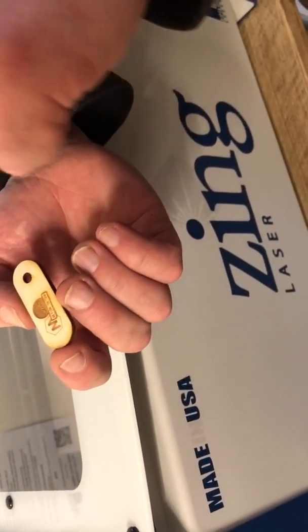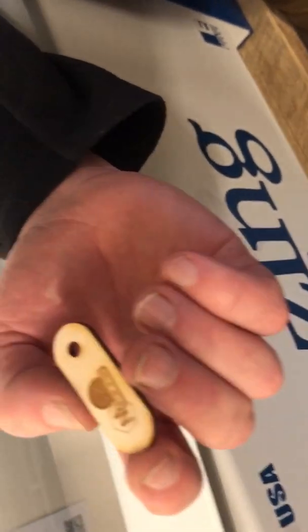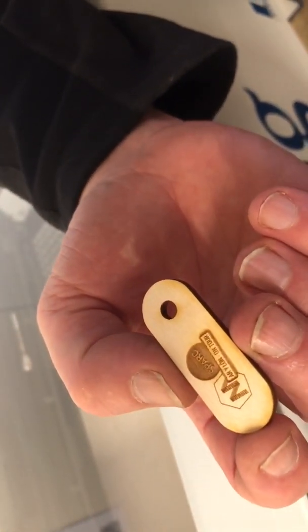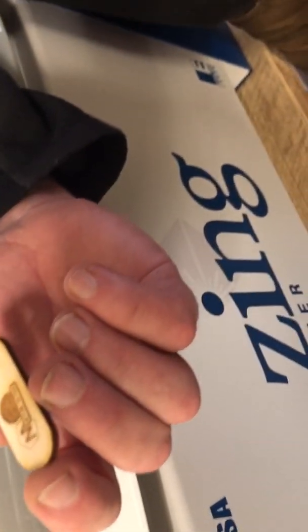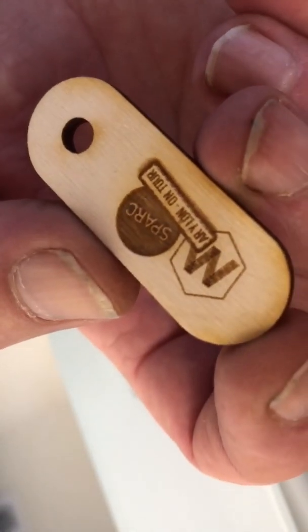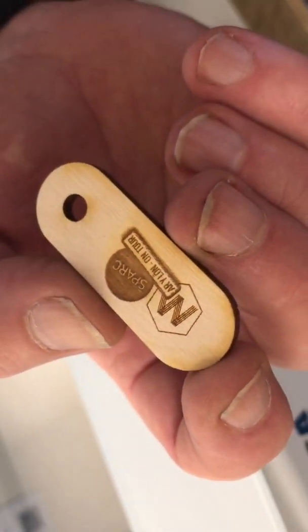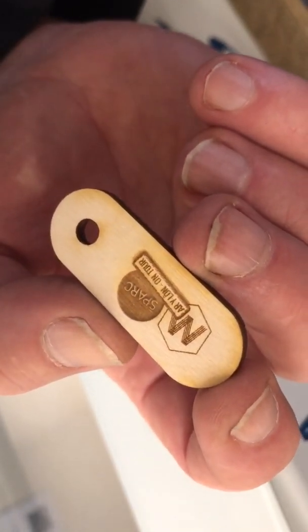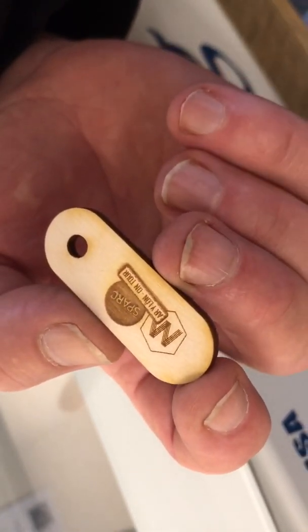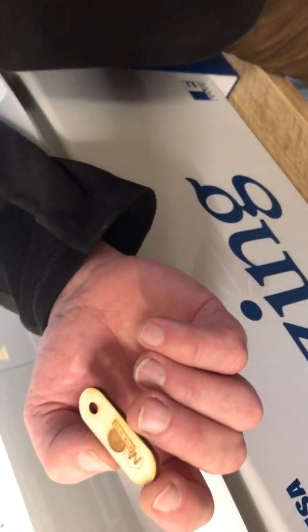So for engraving, what it's looking at really is pixels, areas of colour, and it's going to scan over that area of colour line by line, so the laser's travelling backwards and forwards, left to right, over the area, line by line, okay? So how many lines there'll be will be dictated by how many dots per inch we tell it to use, okay? So that's called raster engraving.